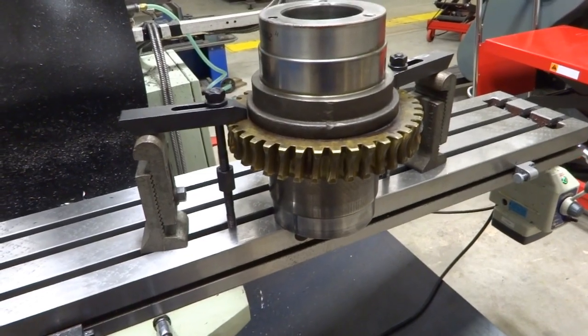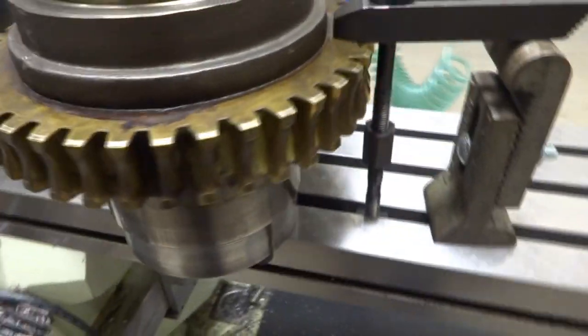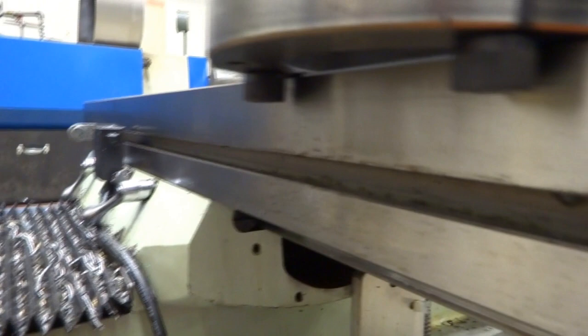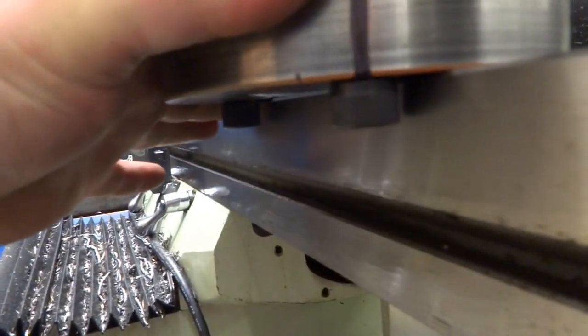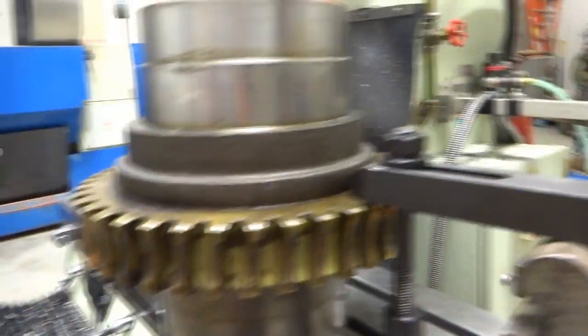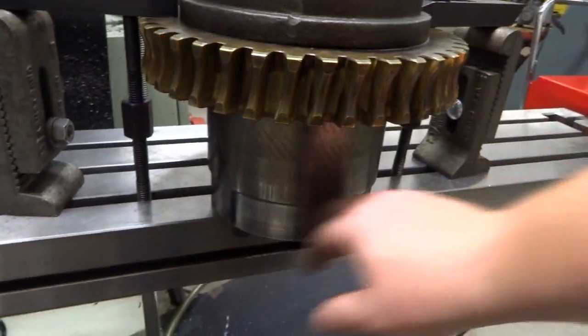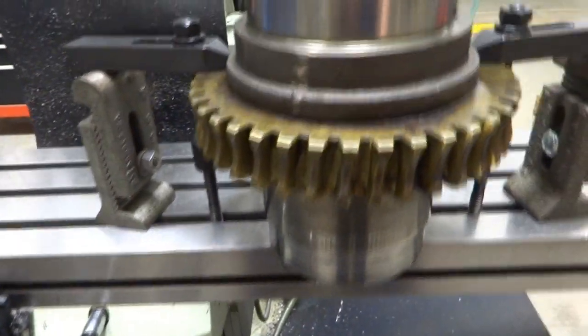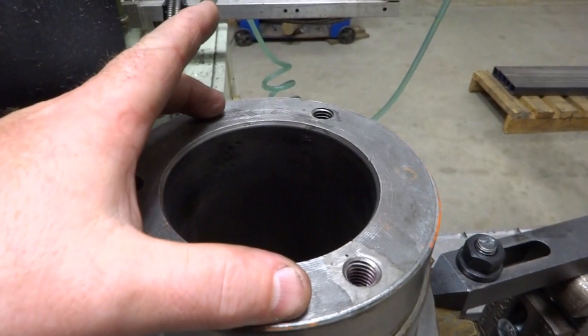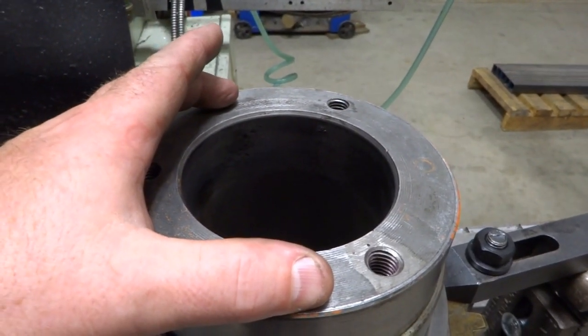I've flipped the shaft end for end and set it back on the milling machine table. You can see under here the bolts are there — I haven't pushed them right up against the table yet, but it's just a simple matter of sliding them over until they both make contact. Then I tighten the clamps down. I put markers here so I know where the original holes were. Now I know that these two are parallel to the travel of the table, and I can come up here and pick the center up again to position my bolt pattern so it lines up with the other one.